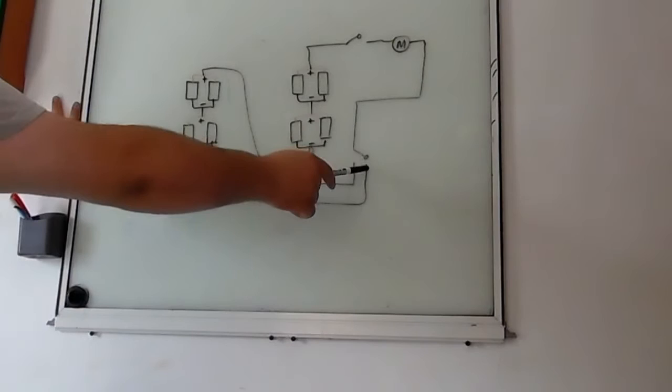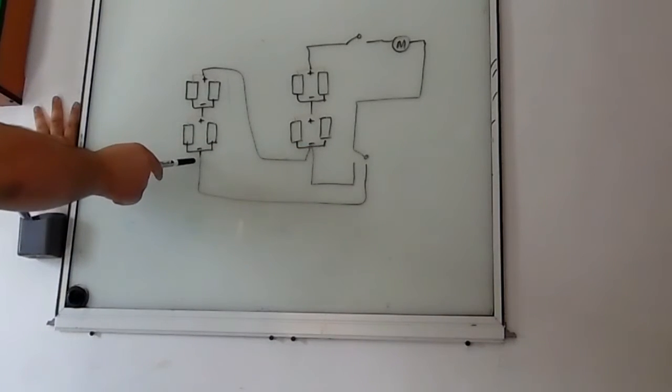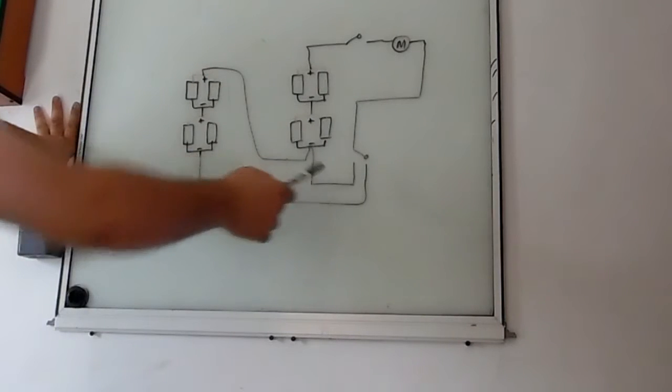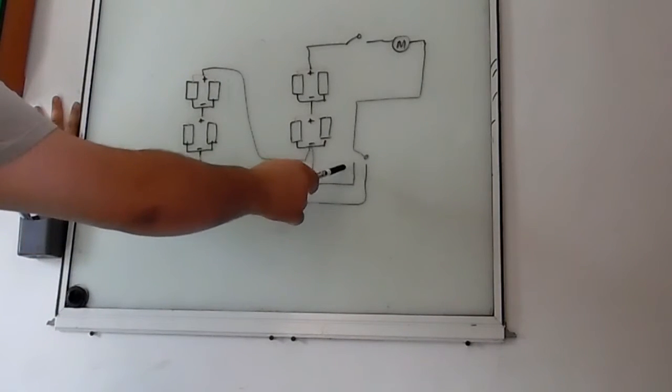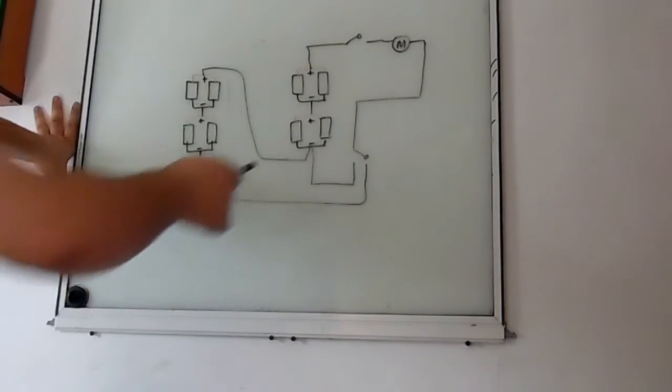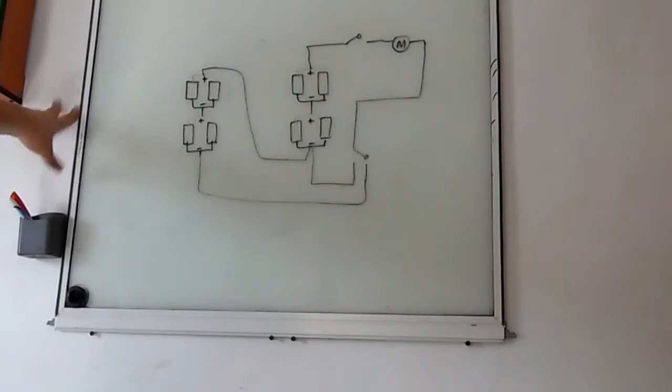So if the switch is going right here, to this ground right here, I'm selecting the high voltage because now it's running in series. This is disconnected, but if I switch the switch over to this ground, which is the 2.4 volts, only that battery is being run. So it's a very simple way of doing it.